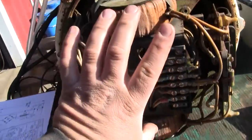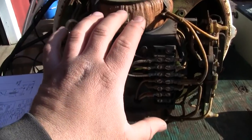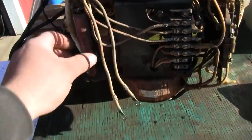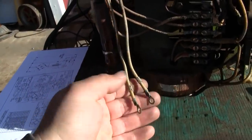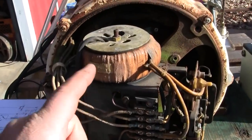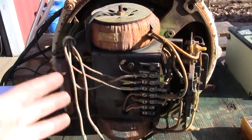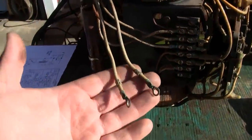So the power that's being fed to the field is also controlled by these gate reactors, because there's more than one winding in here. It has a little bit to do with the control reactor, you might guess. Depending upon the voltage level applied to the input of the Magneciter, a control voltage will essentially buck the field current that's passing through these reactors, and a balance is formed, almost like a mechanical governor, which limits the field current based upon the applied AC voltage.